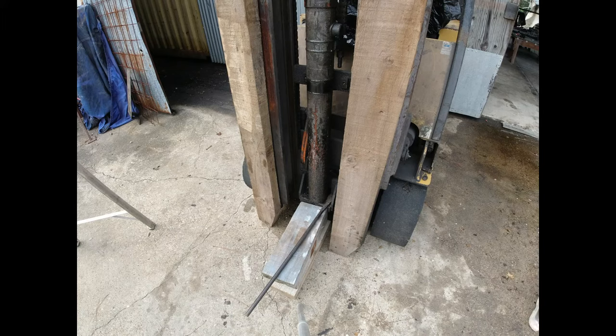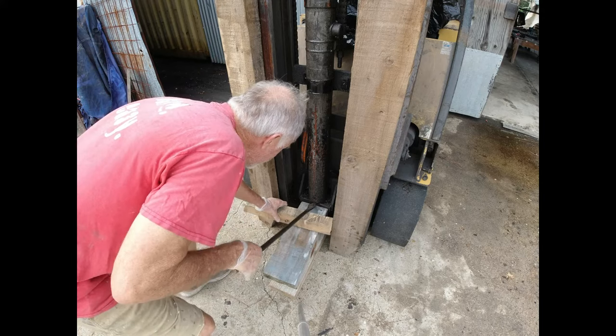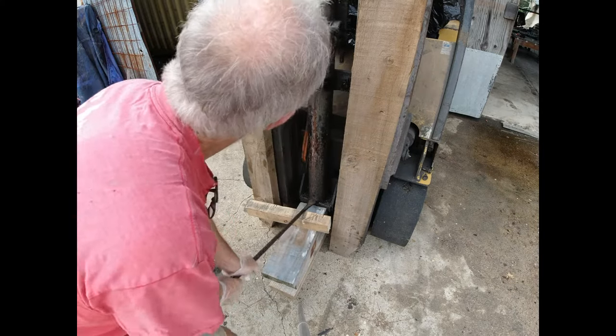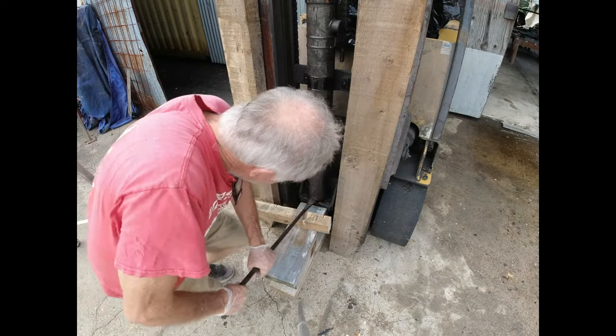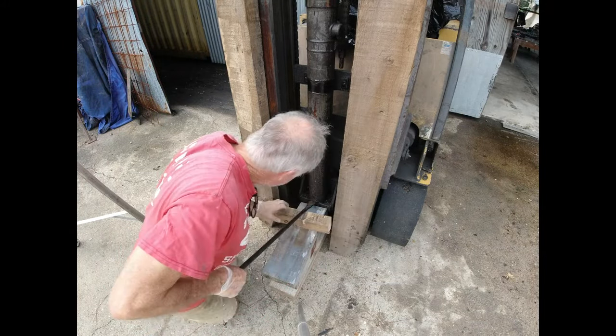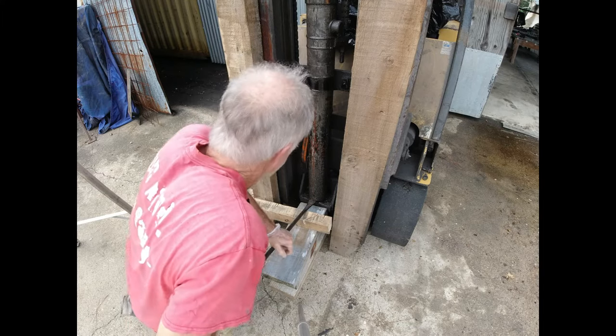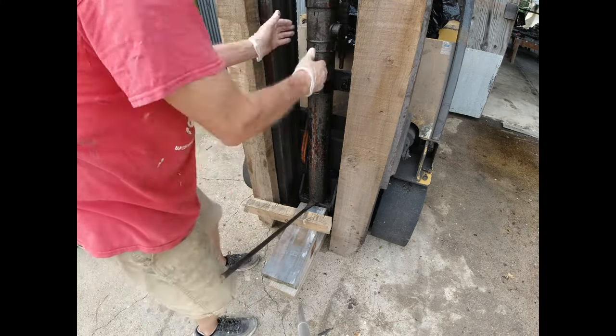This is where my logic went really south. I've been pushing on the down lever, which typically lets the cylinder fall under its own weight, but it wasn't. I think it's because I had the wooden props up there. This whole time I'm trying to compress the cylinder, but what I really needed to do was take the fluid out of the cylinder by removing the hose. There's a little nipple on the bottom of the cylinder casting that fits down into a hole - it can't go sideways until you lift it all the way up out of the hole. That's why I can't get it to slide out.